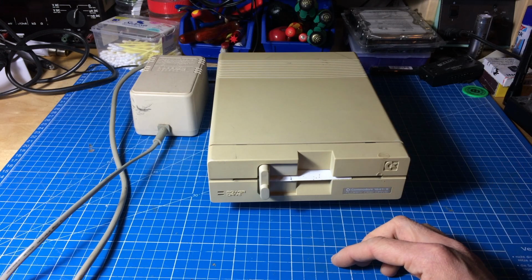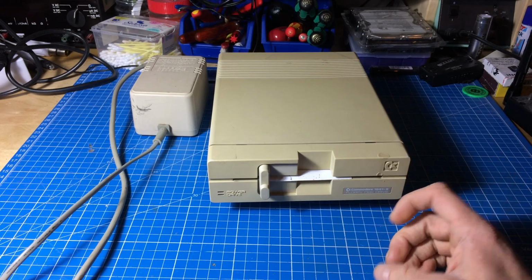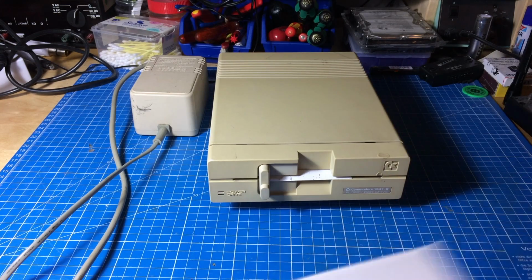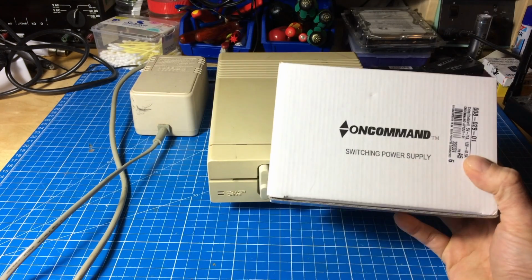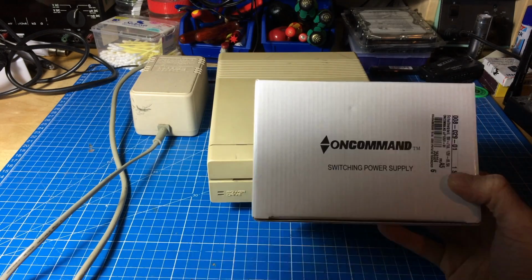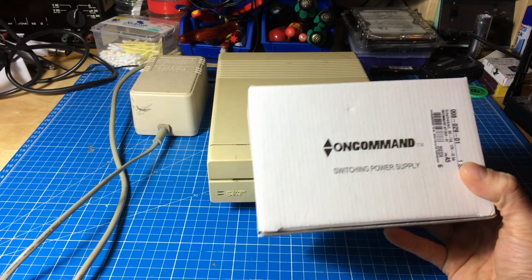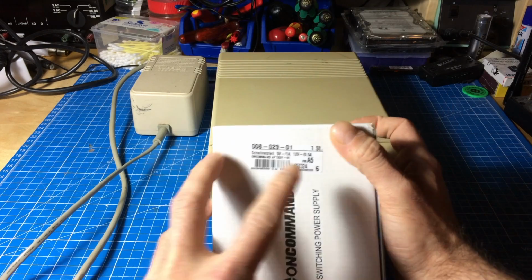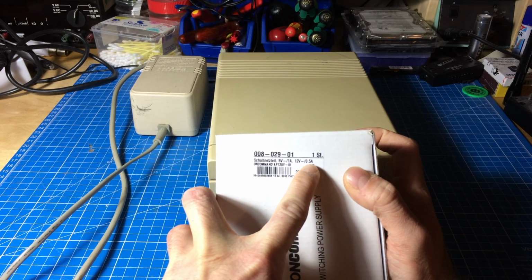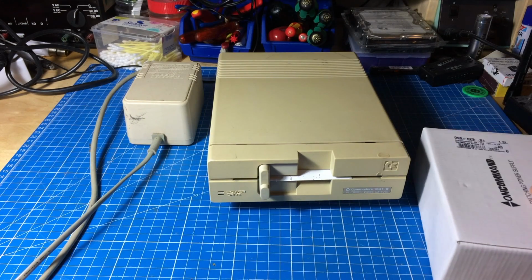So what I'm gonna do is to use the forum post, and I actually bought the replacement that was suggested there for €2. And I will link in where I bought it below in the description, I think, if I can find it. And yeah, this basically delivers 5 volts at 1 amp, 12 volts at half an amp. So that's exactly what the old brick delivers.